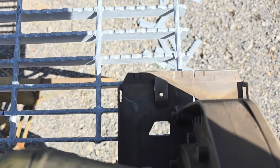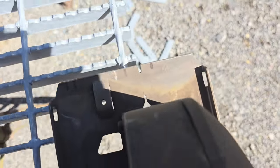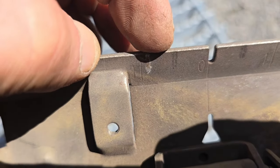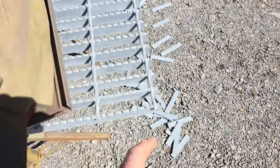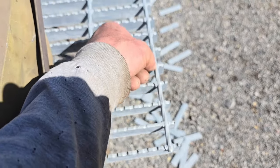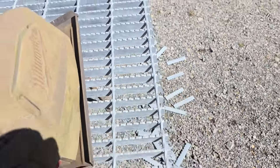And in this case, there's a black mark. I don't know if you can see that. I've got a black mark right there on this fence that is just the right distance from the edge that'll put my blade where I can follow that round bar and make my cut. My saw blade will be out here the half inch away and make my cut.